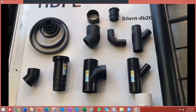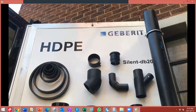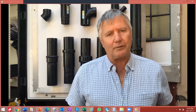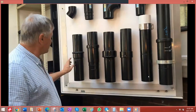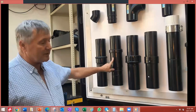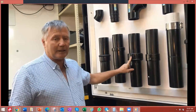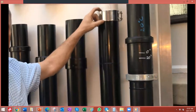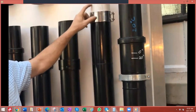HDPE can be manipulated by heating, and once the heating process is finished it cools down and will try to go back to its original state. The basic jointing methods of HDPE on the low pressure drainage side include: a butt weld joint, an expansion socket, a ring seal socket, a union coupler, an electrofusion joint, and a stainless steel coupling for joining unlike pipes — so PVC to HDPE and cast iron to HDPE.